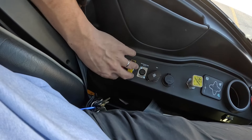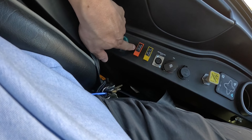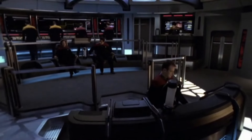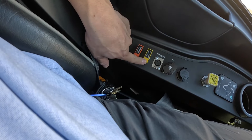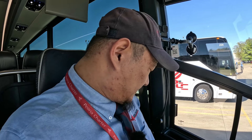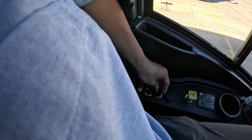The other two switches next to the brake release are also emergency override switches. The emergency cutoff switch, once hit, cuts all engine power and shuts down all electrical power — again, emergency use only. The auxiliary brake cutoff switch instantly turns off all auxiliary brakes such as jake brakes or retarders. While you can turn those off individually with their own switches, this is a more comprehensive emergency switch that eliminates guesswork. Ahead of that is a cigarette-style charger, a microphone clip, and two USB ports.